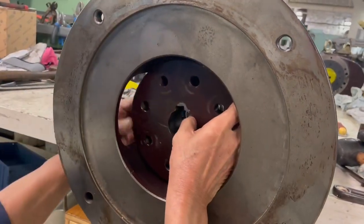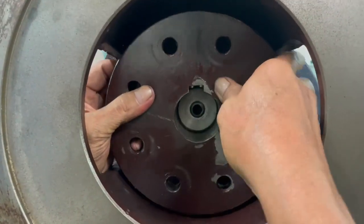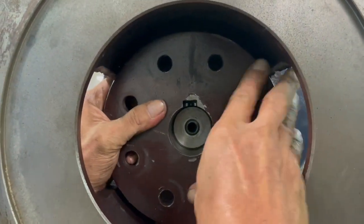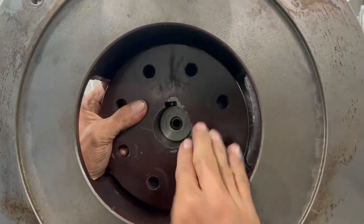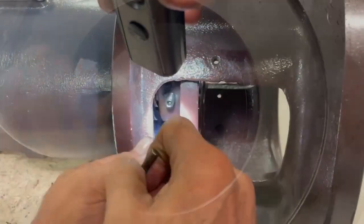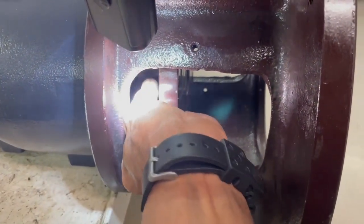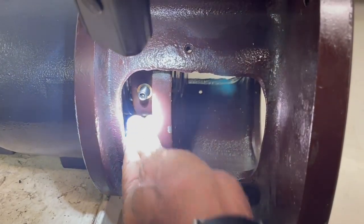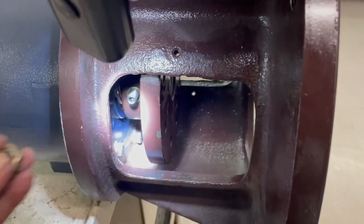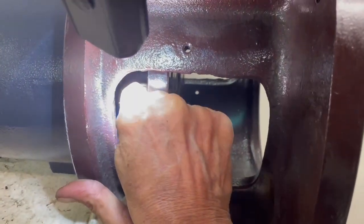The idea here is to replace the compressor itself — we are changing the screw compressor as per the PMS. Now we have the new compressor. We have attached the intermediate piece and now we are mounting the coupling half. In reverse of what we did, we connect the allen bolt for the key to connect this coupling half to the shaft of the compressor.